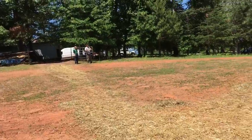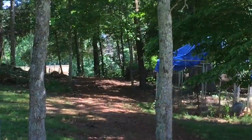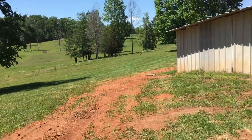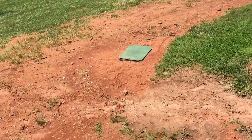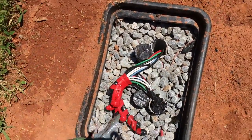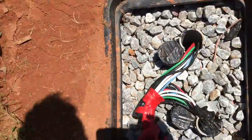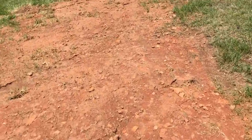I'm going to take you into the mech room now. If you look through those trees in the far distance you can see the corner of the solar array. Here's the trench — I get this comment a lot on estimates that the solar is too far away from the house, but that's just not true. You go high enough voltage, like we're coming in at 380 volts DC. There's our pull box with a bunch of gravel in it and Polaris lugs. At this high voltage you can keep voltage drop under three percent.